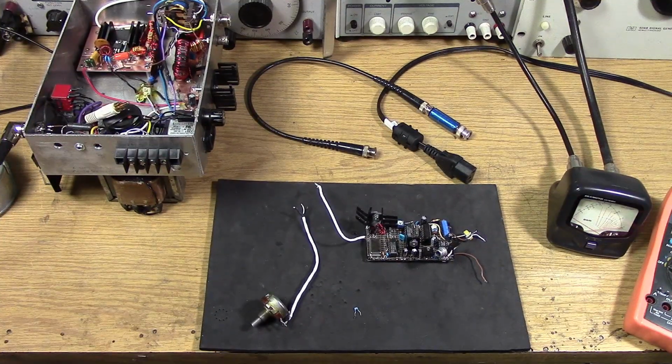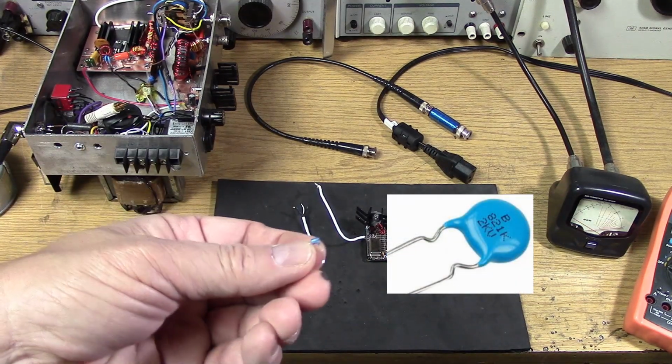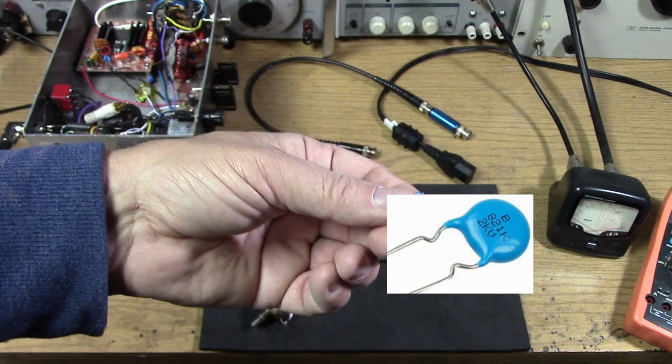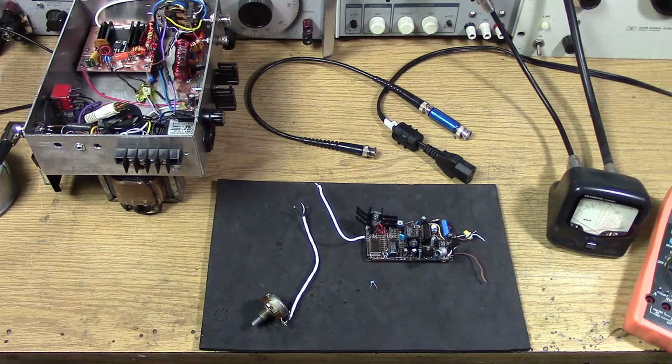As you know, there is an op-amp microphone preamplifier in this circuit, and I have a feedback resistor of 100K, and across that 100K I have a 220 picofarad capacitor. I'm trying to get a roll-off around 6 kilohertz. Well, in removing that capacitor, I got quite a surprise. Instead of a 220 puff, it turns out to be an 820 puff. So the thing was cutting in below 1 kilohertz, and by the time I got up to 3 or 4 kilohertz, we didn't have a lot of audio left. It should have been down around 10 kilohertz. So we had the wrong capacitor installed.